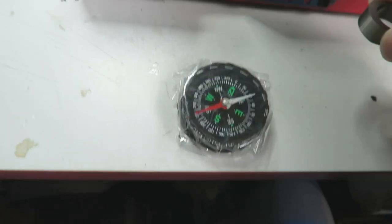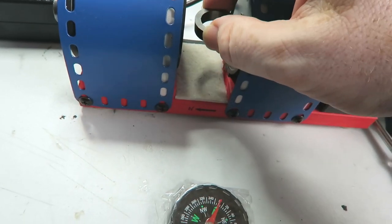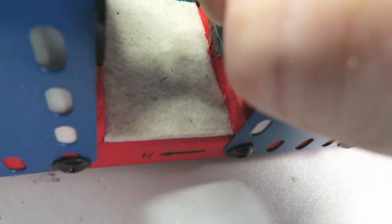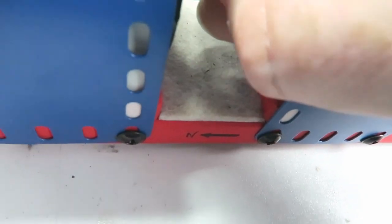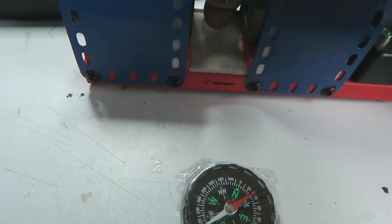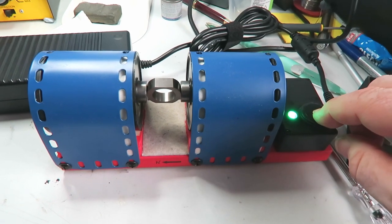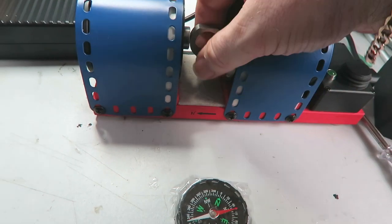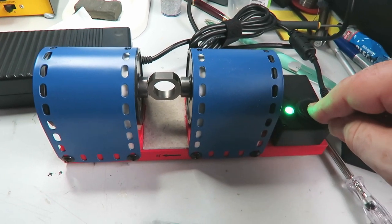So we need to put the north pole into the magnetizer like that. Now it's very hard holding the camera so please excuse the fumbling. There's the magnet in the magnetizer. Now I'm going to hit the charge. I suspect - yes - it's now sticking a lot better. Then we get it nicely centralized between the two poles and give it its final blast.